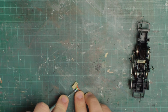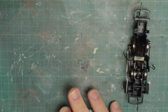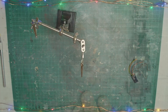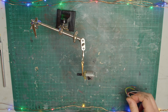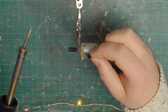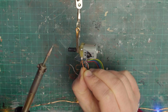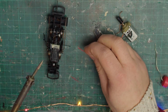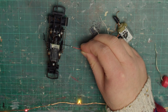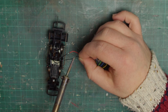I removed the 8-pin plug from the end of the wires, and then using a knife I stripped the ends of the ones I needed to wire up to the motor. With the motor held in place, I soldered the grey and orange wires from the decoder to the tabs on the bottom. Then I soldered the red and black wires on the decoder to the two pickup wires on the loco. This essentially means I've now interrupted the flow of power — it comes into the loco through the pickups, then onto the decoder before it reaches the motor.